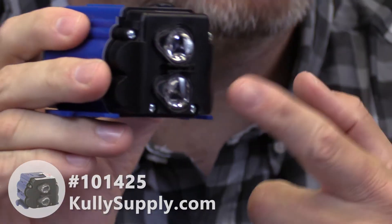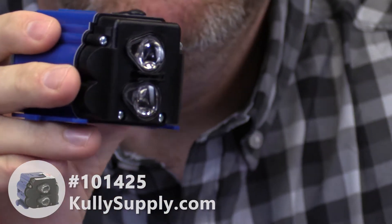When you plug this in or turn it on for the first time, or when you replace the batteries, it needs to calibrate. You're going to want to just stand back and let it do its thing. It wants to sense the room, sense where the walls are. It takes up to 10 minutes and you're going to see a blinking red light through the module. I'd recommend setting this thing up, go have a coffee, come back in 10 minutes and make sure it works okay.